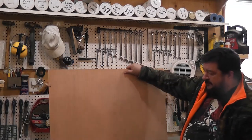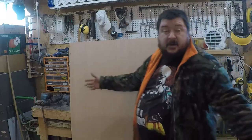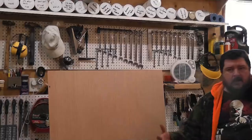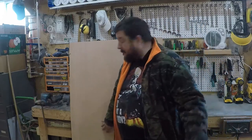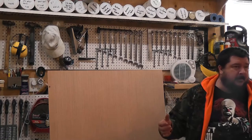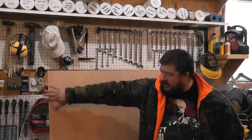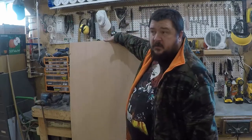So what we're going to do is create a frame for this. We're going to make it 32 by 42 inches, which is a fairly decent size for any regular map or board game. Once I've cut that size on the table saw, we're going to take some other material and create basically ribs for it to keep it rigid and strong, glue it and tack it together, put felt over it, and then create a border that goes around the edges. The material will be tucked in underneath but the rail will still be over top. Maybe we'll do a little bit of stain or paint so it looks nice. If I've got some leftover oak, I think that'll look pretty good.